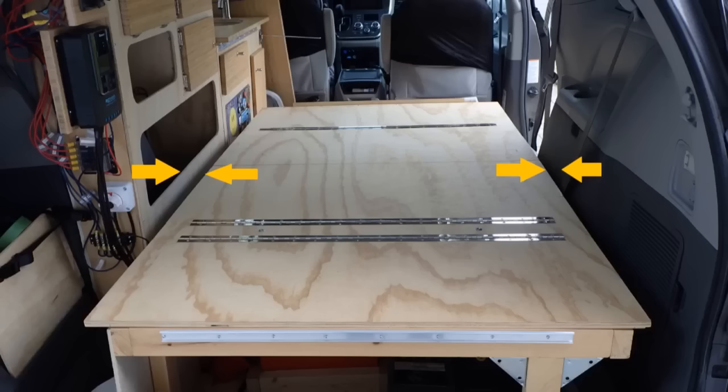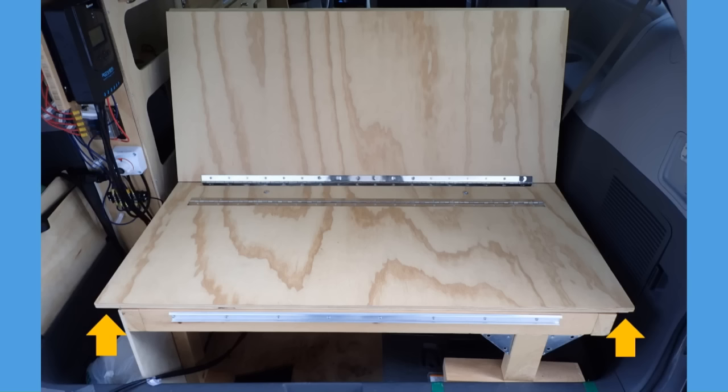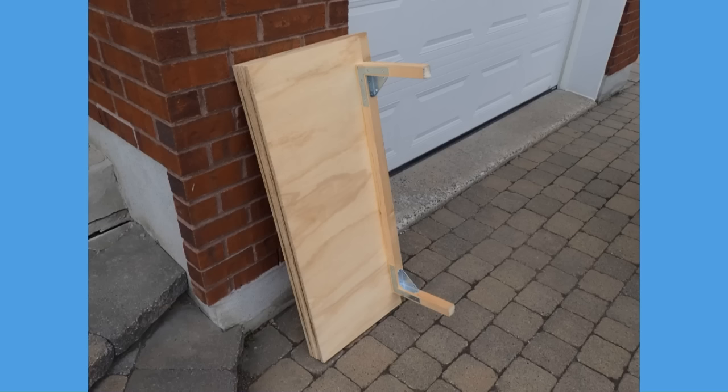Here are some tips. I left 1 to 2 inches between the bed platform and the cabinet, and between the van's wall. This avoids scratching those walls when folding and unfolding the bed. Anyway, you won't fall off the bed with such small gaps. Also, I made the bed structure a few inches smaller than the panel platform. All those gaps end up saving weight and everything is easier to remove and manipulate in the van. So you end up with a folding sofa bed that is light and easy to remove. You can remove or install such a sofa bed by yourself. As you can see, it is also very compact, and you don't need to buy and install any mechanism.